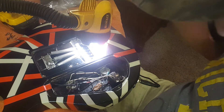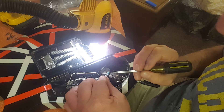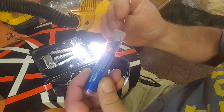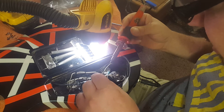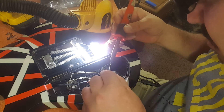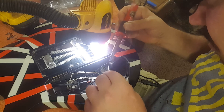I'll show you what we're trying to do. There is a repair right here — you can hear it's staticky whenever I touch it. So what we're going to try to do is solder that little joint right there, the two wires together. We got our solder and we're going to try to lay this under it to heat up the wire. There we go.